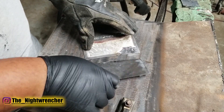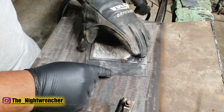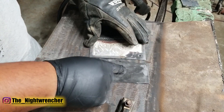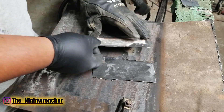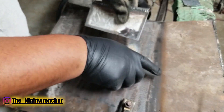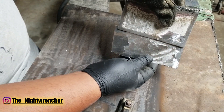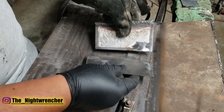There are a couple different ways you can do it, but my favorite is what's called a lap weld, where you overlap the metal instead of doing the traditional butt weld. Typically when you're doing a repair and putting in a patch panel, you can put the new piece of metal behind the existing body panel just a little bit, and then when you do your tack weld it becomes a lot easier.